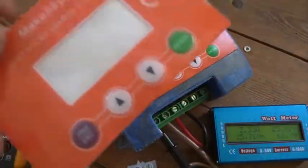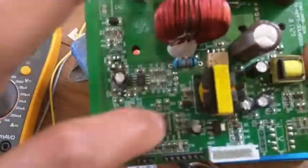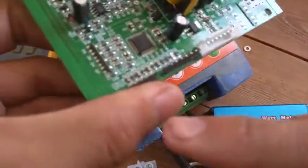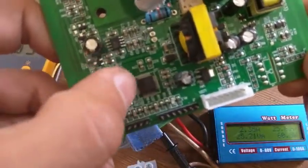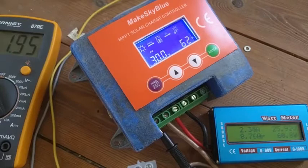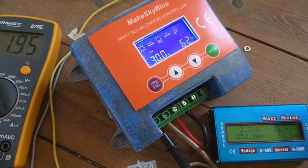For some reason the buttons failed — it's somewhere on this board. First tip for the manufacturer: there should be some TVS diode, some protection diode. I didn't really do anything wrong with it, but now all the buttons here go to ground and something inside is broken.